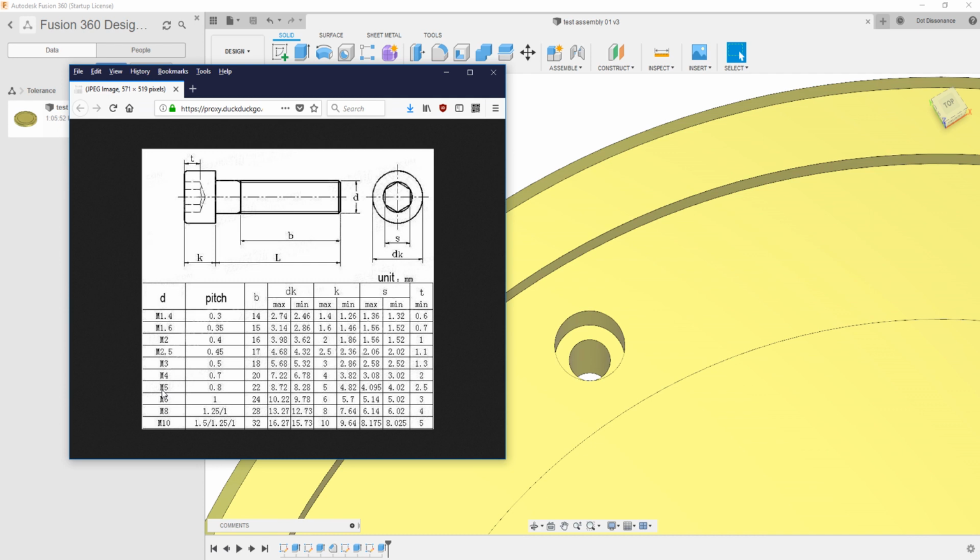Sometimes it's tight enough that they do these things in aerospace called freeze plugs, where you'll actually cool the object, like putting it into liquid nitrogen or something similar, to shrink it a very small amount, just enough to get it in there. You'll hammer the part in and then it'll swell up to fit. And then it's basically a permanent item. Now, you could do that, but that's not what we want to do.